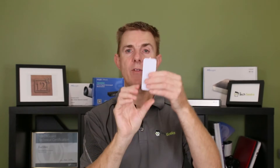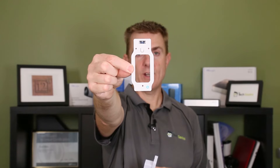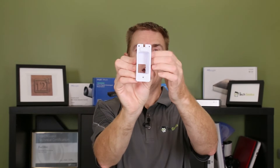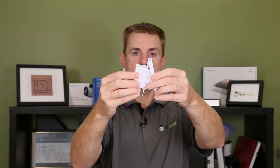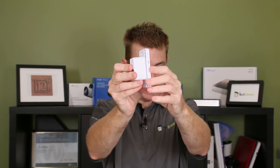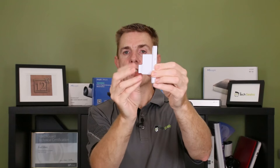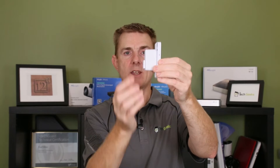There are a myriad of mounting options for this. Firstly, you get a guide — a template with a level on it — showing the basic entry points for screwing it in place. This metal shield goes in first. If you're just going to take a small recess out of the wall, that goes into place, then you bring the reader in and clip it in. Behind the wall, you get a bung that creates a seal around the cable as it goes through, giving a little extra protection.